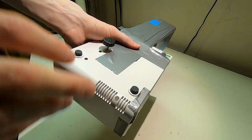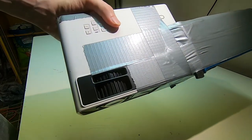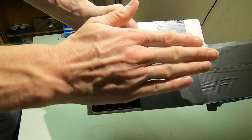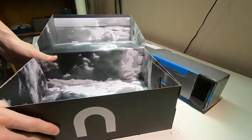We can't put a silencer on all of them, so instead I'm going to put an enclosure around the entire piece of equipment. So if you look at your barrier calculations for attenuation, you don't just want to block the line of sight from your source, but you want your barrier to extend beyond your source. So I'm just using an old shoebox.